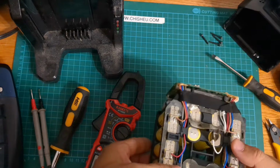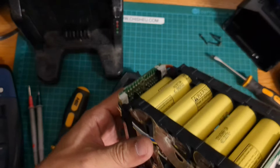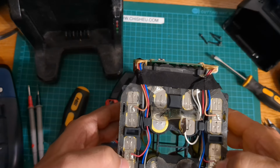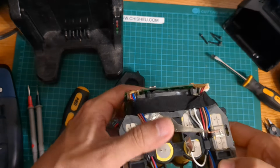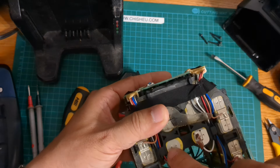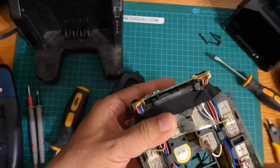So we're going to go over a plan of attack to extract this battery embedded in the middle here. You notice how it's sandwiched between these two pieces of plastic, and every piece of plastic is kind of wedged in with these nickel strips. So instead of cutting anything out, what we're going to do is be very careful, and cut out the outer rim of this plastic case so that we could slide this out and slide a new battery in.